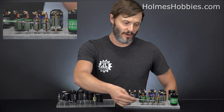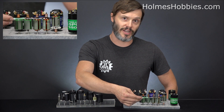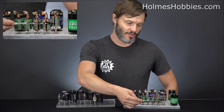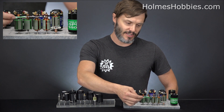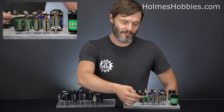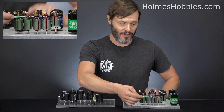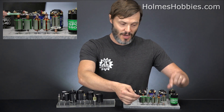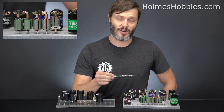The differences between those are pretty much the performance differences of the motor. If we look at our least expensive armature from the Trailmaster Sport, it has wider laminations, so there are more steel losses when it turns. It has a decent amount of copper on the armature, but it's machine wound — certainly not the best produced armature, but it does the job for the money very well.